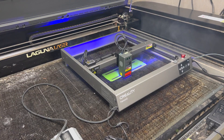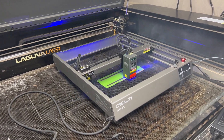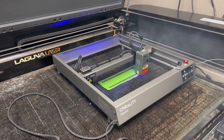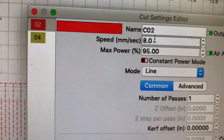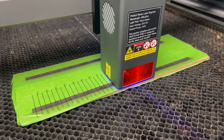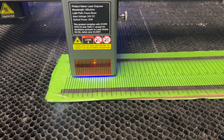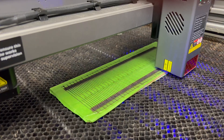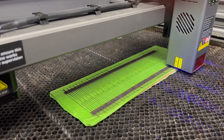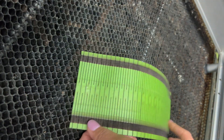This footage isn't sped up because I want to show the real speed of all of this. The engraves took two passes to get thick enough to make a workable ledge for the glue-up, and you can really see the smoke kicking off. I have the ventilation on for the laser bed and I'm watching it wearing laser glasses and an N95 mask. When it comes to PPE in the shop, you're always better safe than sorry. A good rule of thumb: if you see smoke coming out below the workpiece through the honeycomb, that's a good indicator your cut went all the way through. If the smoke is coming out above the workpiece, it probably didn't cut all the way through.